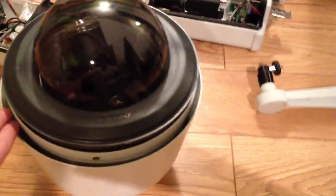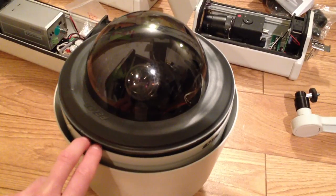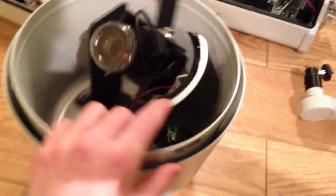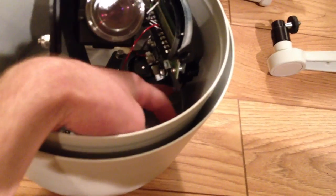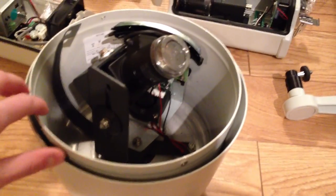Moving over to dome style, which is another type. This is a DF5 — a DF5-OE, environmental — so inside here is another C10DN-6 camera. It has a duct, a centrifugal fan, and a heater element that blows warm air to the camera and to the lower dome assembly — that's how this one works. The full model is DF5-PG-E1. It looks like they've put a sticker over where it says CE.